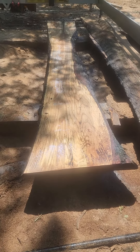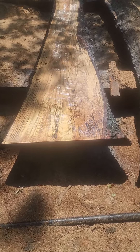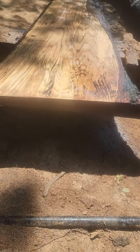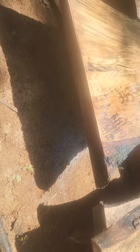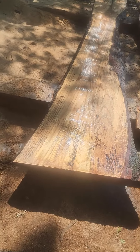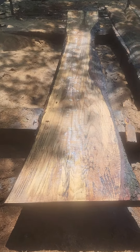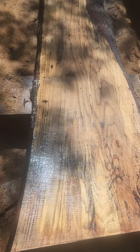This is the backside of number five. When I flip them over I'm having a problem — see how, I don't know if you can see with that shadow, but from over here it's about two inches up to about almost three inches. This really gets off when I flip it because my two beams that hold the log are not parallel or not level with the whole machine.